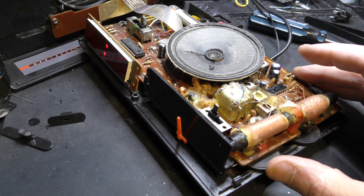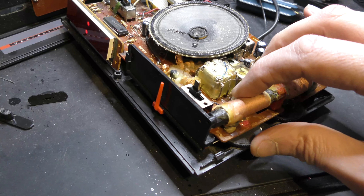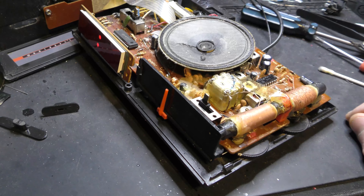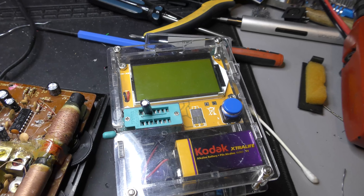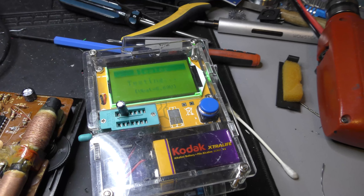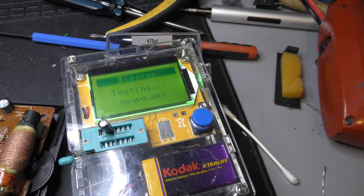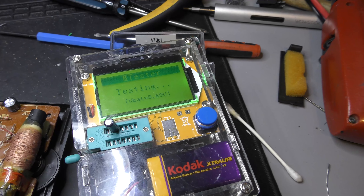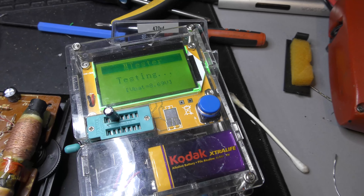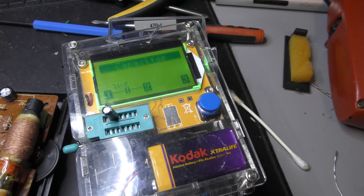We now have working tuning - that's kind of cool. I thought I'd change out some of the capacitors and check them on the meter. This one is rated at 100µF 16V. It takes forever to test and then comes up at a ridiculously low value - 31pF instead of 100µF, so that's it for that one.